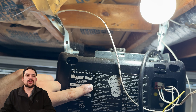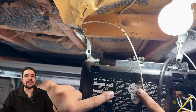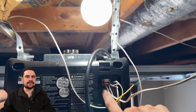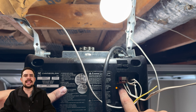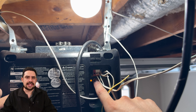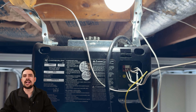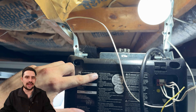Most openers will provide instructions on how to reset and program remotes on the back, which is really useful. The first thing I'll do is fully reset the opener. To do so, I'll press and hold down the learn button for six full seconds. The instructions tell me that the learn button is the yellow one and that a yellow LED will turn on. There's the LED — now we wait until the LED turns off. Once it does, we'll know that the opener has been fully reset and I'll release the button. Any remote that had been programmed previously will no longer work now.